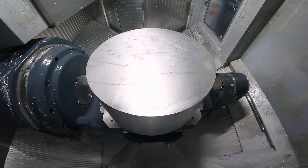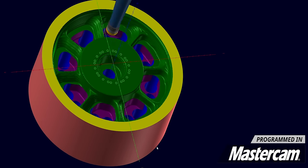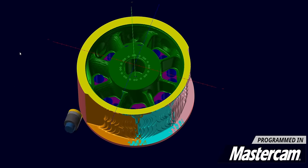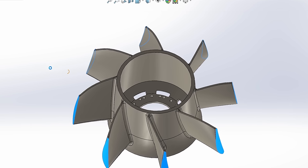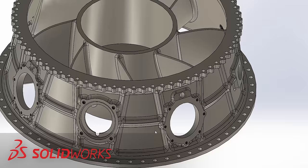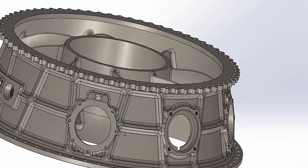If you're wondering what you just saw, that was the stock prep operation for one of the most complicated parts we've ever machined here at Titans of CNC. What this is going to end up being is a 24-inch diameter shrouded impeller. A normal impeller is hard enough because you have the pressure side and suction side of the blades, the shroud surface, and the hub surface. But with this part we're also going to be adding a full shroud complete with all different kinds of fittings and other geometry. That's going to make this part exponentially harder to machine.